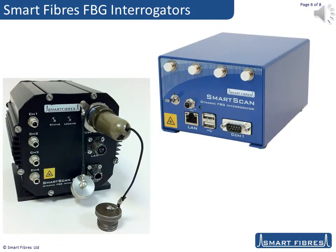To analyse these FBG sensors and transducers, we have developed a range of optoelectronic interrogator units. They offer measurement from stable and static to highly dynamic with tens of kilohertz data sampling. They are small, rugged units developed with commercial off-the-shelf components from the telecom sector. This makes them affordable and provides an insurance against obsolescence. Being all solid state with no moving parts, they are incredibly robust.